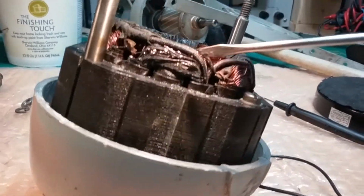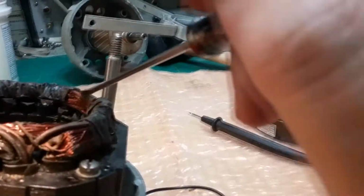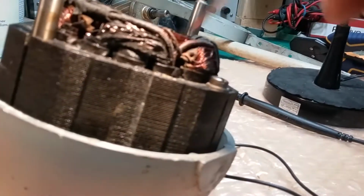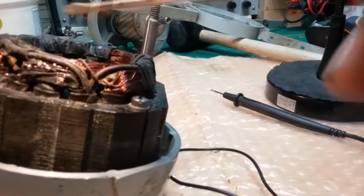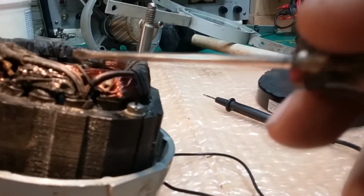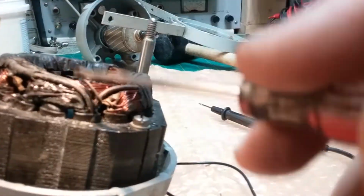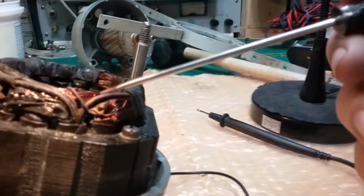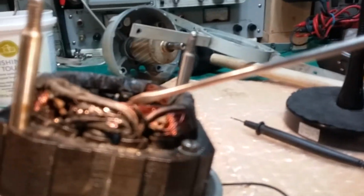And this one inside, this one that goes around, it looks like it goes this way. Those are still coils inside going the same way. It's just that they're bridged in a different area. They go from here to here rather than from here to here and here to here. They go across, they're in between. And that's the phase shift that makes the motor run.